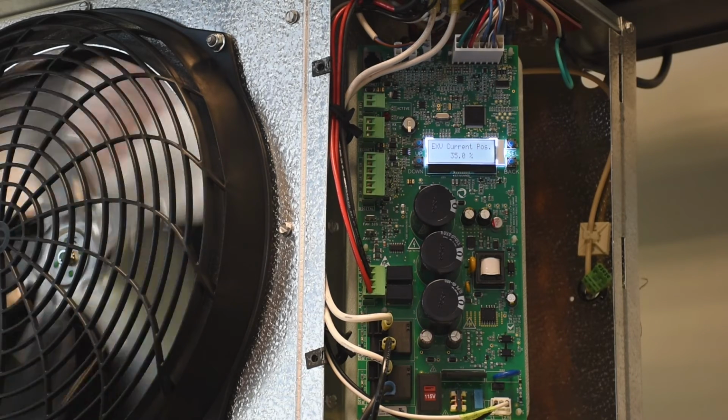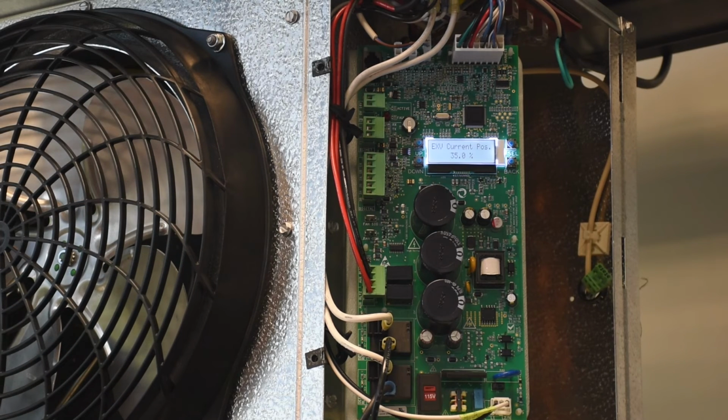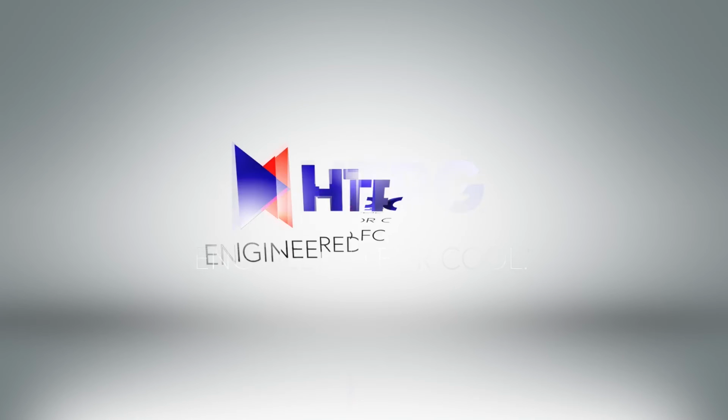This right here is basically the controller opening the valve, and now it's counting on the compressor then to start based on the compressor pressure switches. And of course, the fan is stopped for the moment because right now the controller is also waiting on the temperature of the coil to be below a certain temperature for the fan also to then start cycling to full.